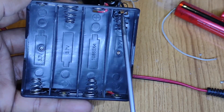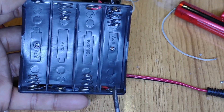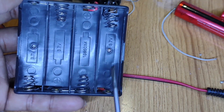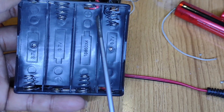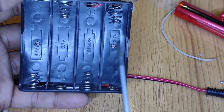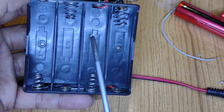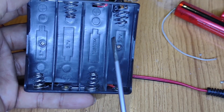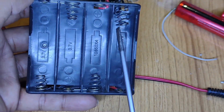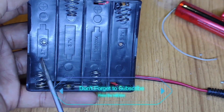So when I disconnect each other, this connection is going to connect with this, and this connection is going to connect with this. First the positive side and the other positive side connect each other, and the negative side also connects both batteries — this is a parallel connection. This battery holder cannot support two batteries in parallel by default, but after modification I can adapt two batteries with parallel connection and the other two batteries in series with each other.